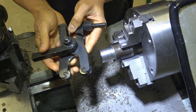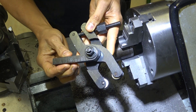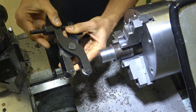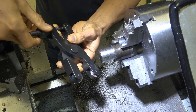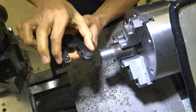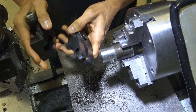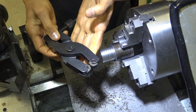Next I'm going to try out this new knurling tool that I got recently. This goes into the tool holder and it has an adjustable gap which can be altered by this nut down here to allow more pressure to be applied evenly on both sides of the part. Now I'm going to go ahead and flip the tool upside down.